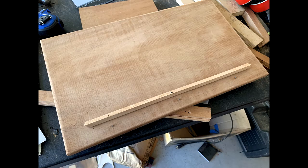Here's the top. Because it mounts at an angle I added a bookstop. If you look closely, there are three 90-thousandths steel pins protruding up out of the top piece. I drilled three slightly smaller holes in the bookstop then pressed it into place for a nice tight fit.